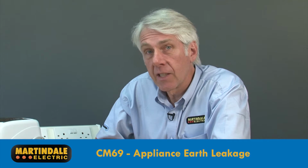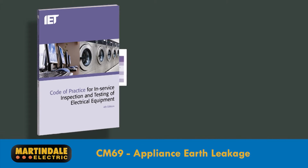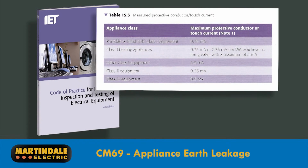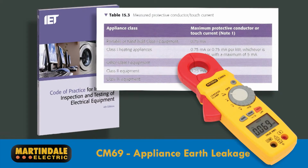Earth leakage testing is an optional test for portable electrical equipment, and there are recommended maximum values for earth leakage current in the IET Code of Practice for in-service inspection and testing, which can be as low as 0.25 milliamps. The low current capability and 0.001 milliamp resolution of the CM69 makes it ideal even for the lowest limits allowed.